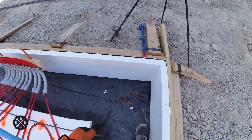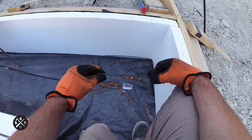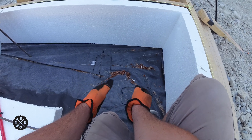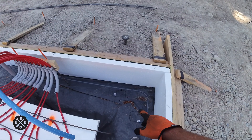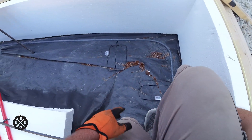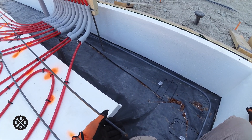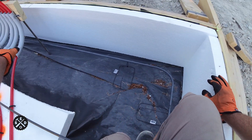In the footers I got these chairs — that's what they're called — and I got the wider ones because they're sitting down in here. The rebar is going to sit on top of them, and I'm going to center it in the footer and make the bend here. These rebar chairs sit in the bottom of the footer and just keep the rebar up off the bottom, because when they're pouring they don't want to have to pull it up with rakes. It just makes it stronger that way. I got some to sit every so many feet.